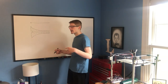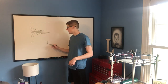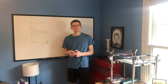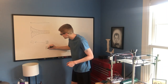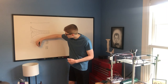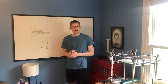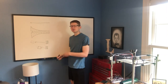To explain that, let's say I have an electromagnet over here and a piece of steel somewhere over here. You have a pretty great distance between them, and because that distance is so large, the force pulling the steel towards the electromagnet is not very high. Now in a second scenario, with another electromagnet — same size, same current, same everything — and another piece of steel with the same properties, but placed much closer. You have a very small distance between them. Everything is the same except the distance, and we understand intuitively that the force applied to the block of steel will be considerably larger because they are considerably closer.